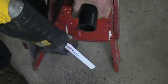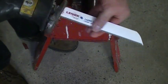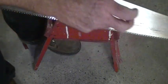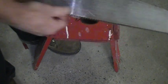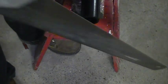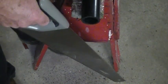One thing to keep in mind: if you're cutting with a hacksaw or reciprocating saw, I always go with 18 teeth per inch. And a big reminder — if you're using a hand saw cutting pipe, draw back two or three strokes before you actually come down with the saw. That will save you from having a nasty knuckle. Thanks for watching, have a great day.